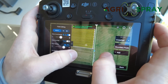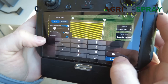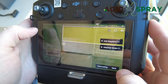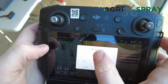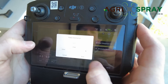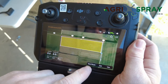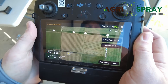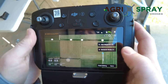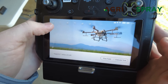You can set downwind buffers, whole-field buffers — there's a lot of things you can do. Once we have our boundary the way we want it, we go back, hit save, and input a name — 'Demo' — then save. If you're marking out a bunch of fields in one day, you can just hit 'New Route,' plan another field, and mark out another boundary. Make all your boundaries in one day, then when you show up to the field you already have them ready to pull up.